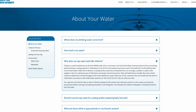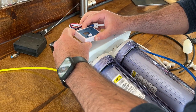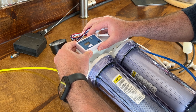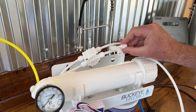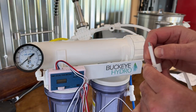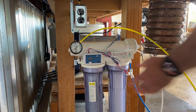Quick tip: check with your local water authority to see what kind of disinfectant is used for your water. I found I did not need to add the chloramine filter due to how my water plant treated the water. The installation of the TDS, or total dissolved solids, meter is pretty straightforward. I attached the meter right on the RO system, then attached the quick connect T to the incoming water supply and added another quick connect T to the outgoing hose. I then added the outgoing and incoming sensors for the TDS meter.